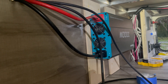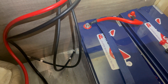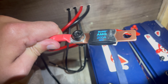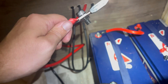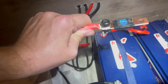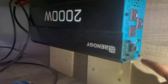Now that I have the negative and the positive connected to the inverter, I'll connect the negative and the positive of the inverter onto the battery. I have a 200 amp fuse on this. Make sure that before you actually put it on, you touch this to the terminal — it's going to spark — and then you'll be able to put the fuse on. That's on there. Let's see if we got power — moment of truth.